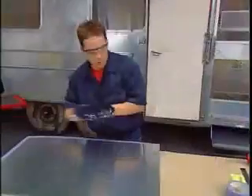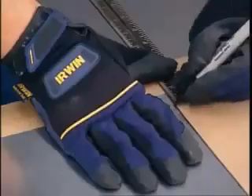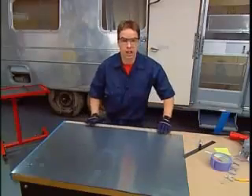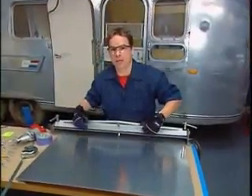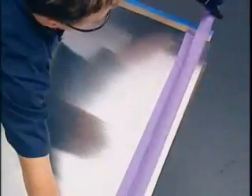Now there's my countertop. Take off our tape guide. Next, I measure and mark my bending line for the lip of the countertop. Now we're ready to go ahead and bend our 90-degree lip. We'll use a metal bending brake to create the lip on our sheet aluminum. These can be rented from metal supply companies. Inexpensive hand bending brakes are also available, or have a heating or roofing contractor make your bend for you. This is my top side — it's going in the jaw and I'm going to be clamping it down, so I'm going to protect it right where we're going to bend. That's just a good preventative measure that's going to keep us from marring our top surface.